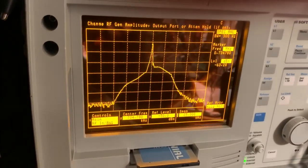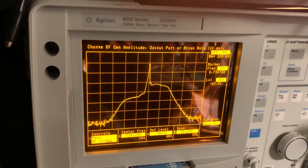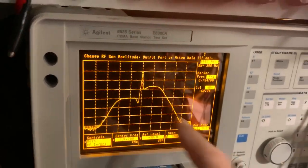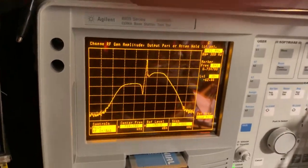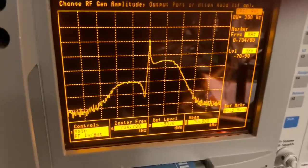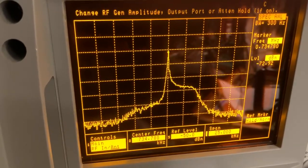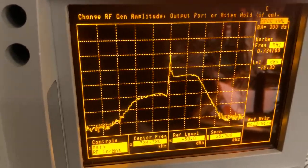Again, I can change that curve quite a bit with the crystal phasing control. But again, 300 hertz is not really capturing the extreme peak of this curve. We're managing to get the null a little bit better, but the peak isn't there. It's missing it because the peak is so narrow. And on the steepest selectivity position, again, its resolution bandwidth of 300 hertz just isn't there to capture the peak of this curve, and that's why I prefer to use this analog setup here.